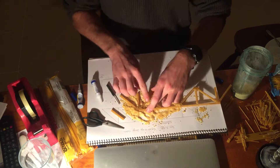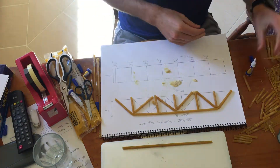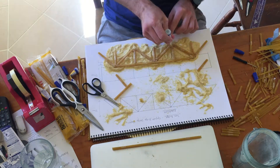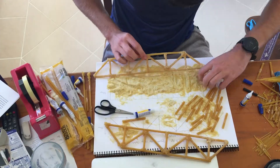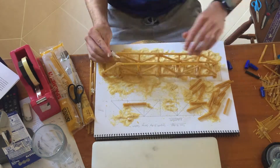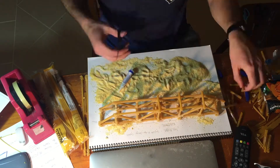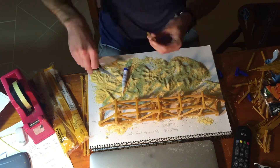Step 10: referring to full-scale design drawings to set out all of the individual members required for construction. Step 11: completing the construction of two entire spans of the spaghetti bridge by applying Selleys quick super glue and spaghetti granules to create joints and form the structure. Step 12: finalizing the construction process by bonding all strut members, including the two load supports, to the parallel top and bottom cords through the application of Selleys quick super glue and spaghetti granules.